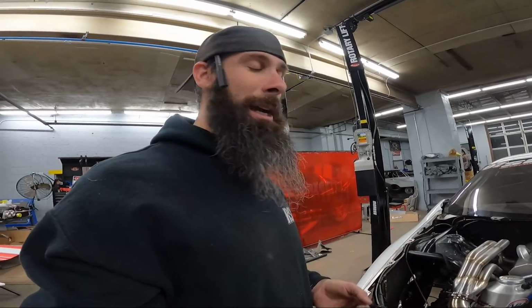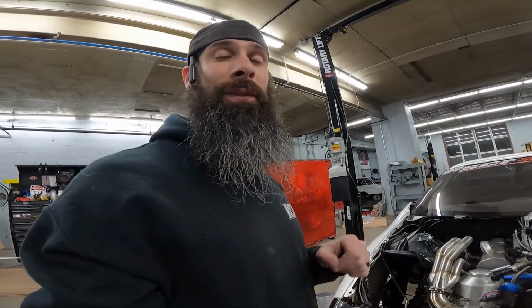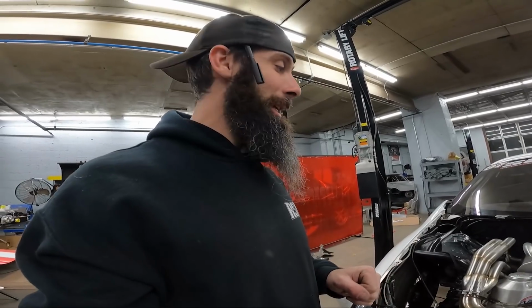So that just saves you some time from having to take it, put it on and take it back off, and vice versa. If you can just do it all in one step and take it off, do all that in one step and put it back on, and you're done. So that's what we're gonna get to now. I'm gonna go ahead and fit the other one up, the notch in it, get it welded up, get it fitted on this side, tack them up, make sure they match, and then we'll start actually welding these things on.